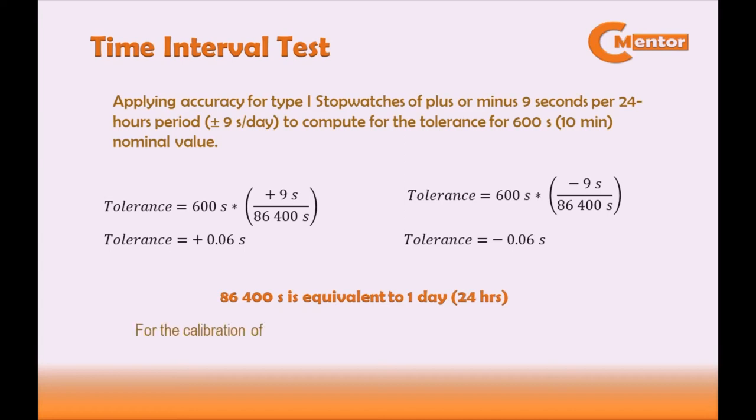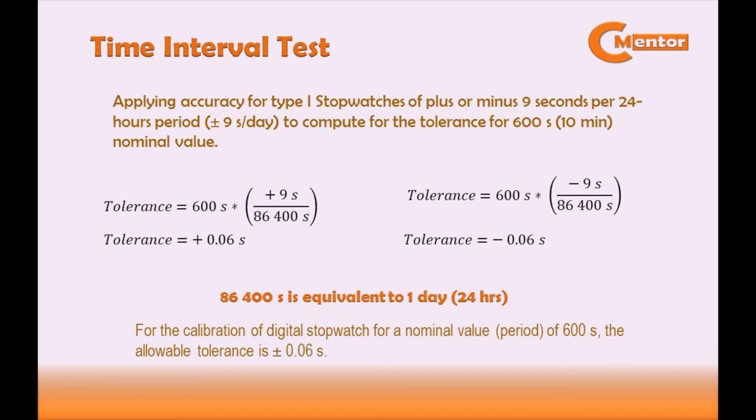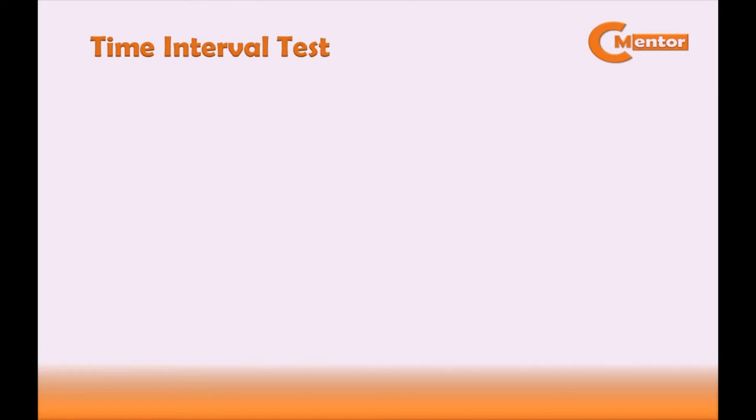For the calibration of digital stopwatch, for a nominal value of 600 seconds, the allowable tolerance is plus or minus 0.06 seconds. In the next video, we will calibrate the stopwatch in a period of 600 seconds or 10 minutes in a nominal value. Now, let's do the calibration.